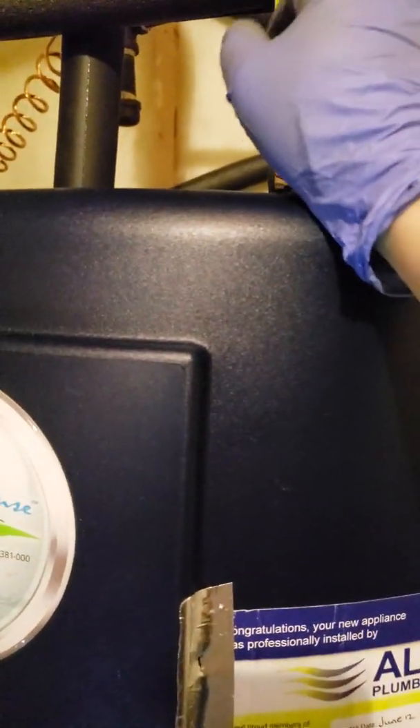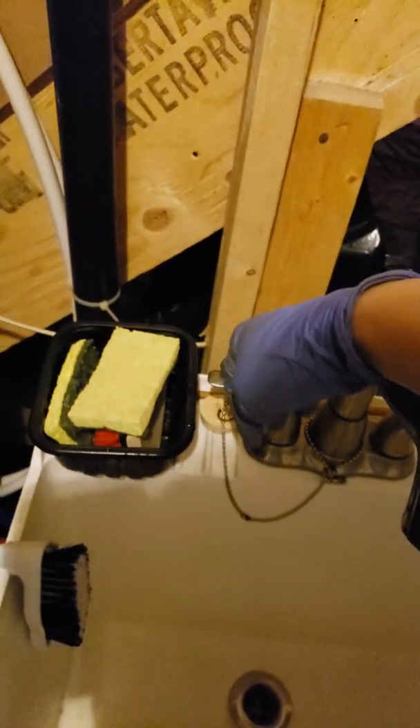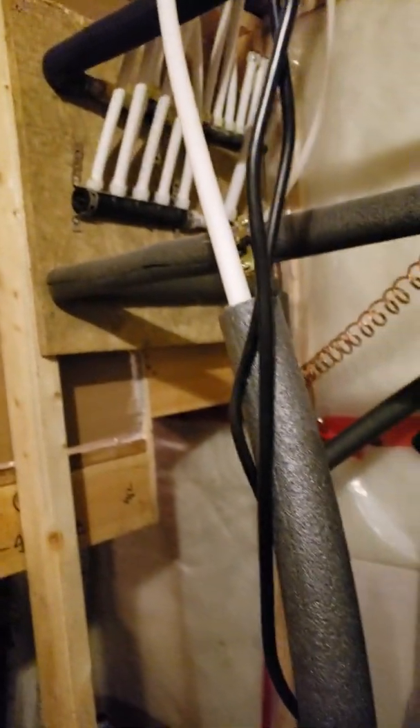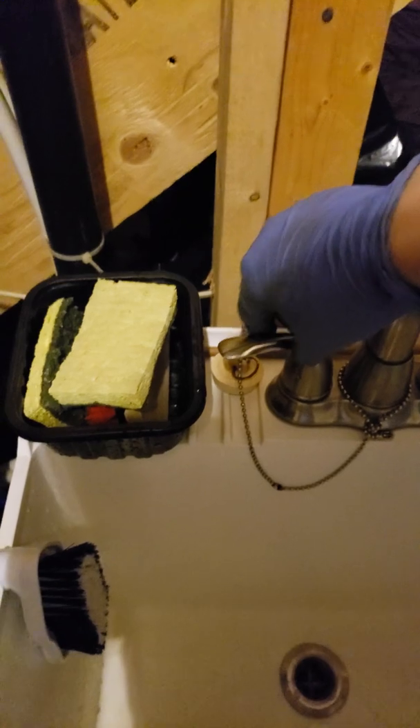A good way to prevent air from being trapped inside your system is your air relief valve. Upon opening, allow all the cold water to come in fully. Open up all the hot faucets — the hot side — to allow all the air to drain out of all your tubing from the basement. Every line has air, so you want all those air bubbles to drain out by opening all the hot side taps, then let the tank fill up.